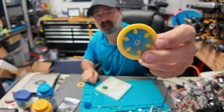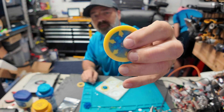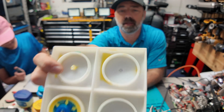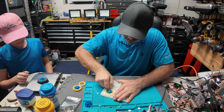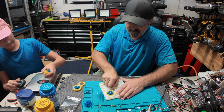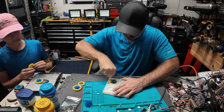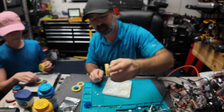This one got a little bit of urethane underneath the rim and it actually glued the peg to it — so now our mold is missing a peg. We only got one more to get out. The new tire weighs 24 grams versus the old one at 28 grams — so we're saving 4 grams per tire, 16 grams altogether. We're going to print this mold solid next time. Two pegs lost — 50/50 on the pegs — but we have four perfectly good tires.